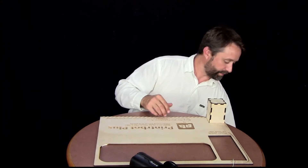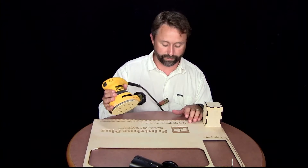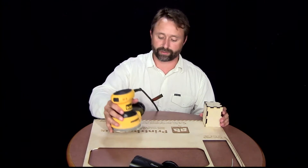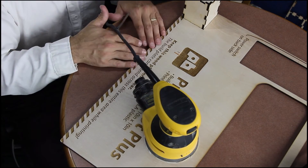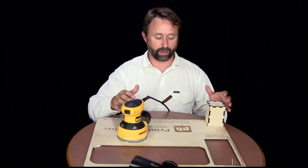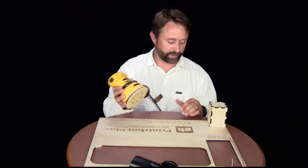As a result, the sander did actually go through the veneer — it goes through pretty quick. This cheap floor underlay has a very thin veneer. The higher quality plywood we used is one of these two-foot by four-foot project boards from Home Depot with a birch veneer that has a slightly thicker veneer. But regardless, it's best if you use that scrap frame because the last thing you want to do is do all the etching, all the cutting, and then end up blowing through the veneer with the sander right before your final finish.